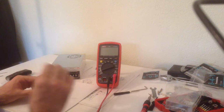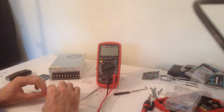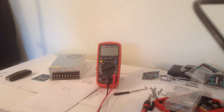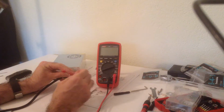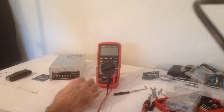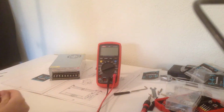You never ever want to tin it before you crimp it. If you're a solder maniac, you might want to solder it to the terminal after it's crimped to increase further the contact patch, although it's not really needed, but never ever before. So that was my safety warning.